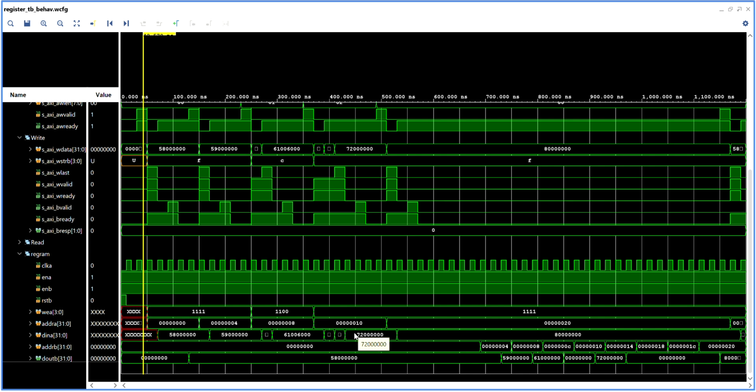However, it turns out that the regram doesn't do any kind of burst logic. So therefore, when you see that we're putting in the bursts, however, when we read out of this regram, we're not getting the bursts. There's zeros in here. And like in this case, it's missing the 60 because 61 was the last one, and that just happened to be the last one while it was valid. Here, we're missing the 70 and the 71. Here's our 72. And of course, that was the last ones that we didn't write to. And so it didn't have burst logic.